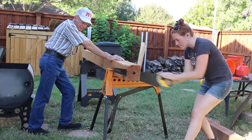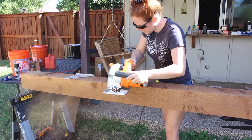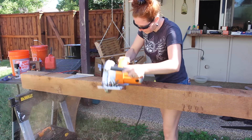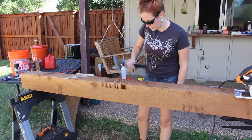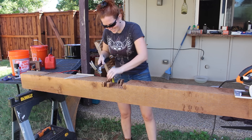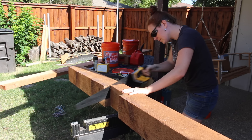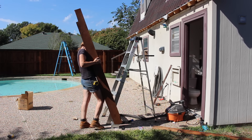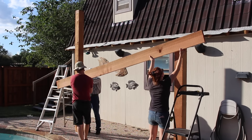With the post being so thick and requiring an angled cut, I couldn't use my circular saw, so I resorted to a hand saw to make those cuts. Next I moved up to the top to cut out the notch that will hold the 2x8 header. To make the notch, I used my circular saw to make multiple cuts in the area, then used a hammer to break it all loose. Afterward, I came back with a chisel to make the surface a little more smooth. Then I cut the post to its final height — three cuts with the circular saw finished off with the hand saw — and set it in place, attaching it to its bracket.